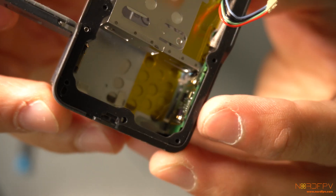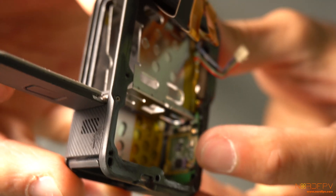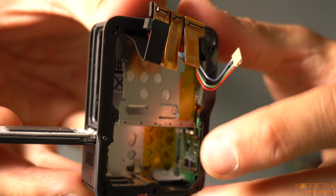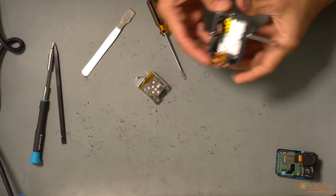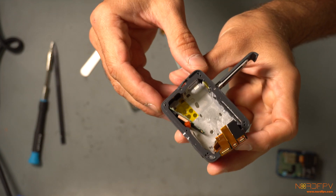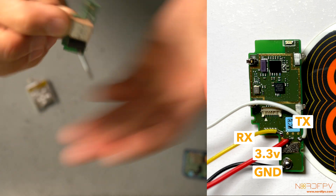I'm going to try to get that GPS that was left during the process of creating the naked GoPro, install it on my drone, and see if it works. I'm going to assume that you have opened your GoPro and you can see inside the pieces. That one there is the GPS — that's the one we want to remove. The process is not complicated; it's mostly glue, and once you remove the battery cage you can remove the GPS easily.